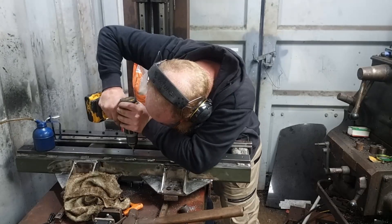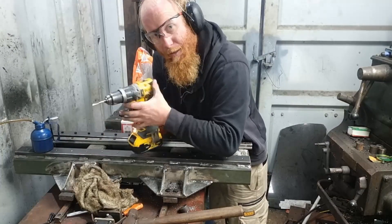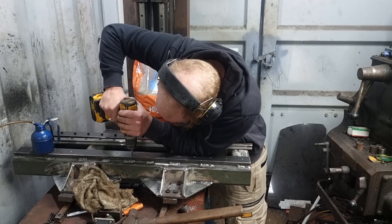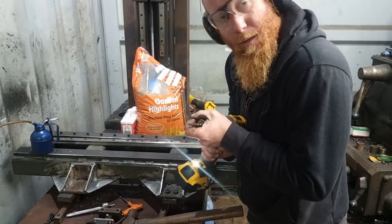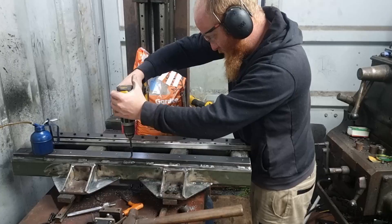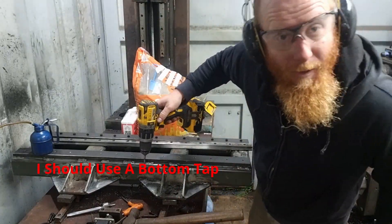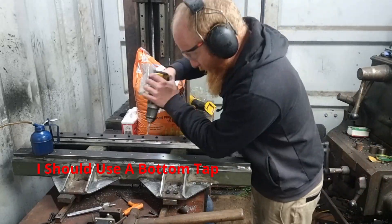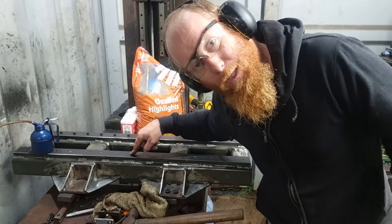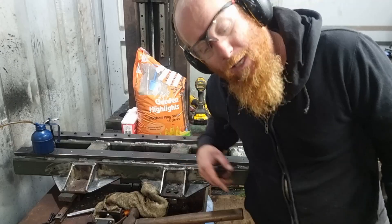Wrong hole. Keep it clean of chips, reapply a bit of oil. Test that hole — it's a little bit tight at the end. I think these taps might be a bit short; you have to cut a really nice thread on the bottom of the hole. Oh wow, that's the broken bolt fix and the missed hole tapped. So I guess we'll chuck all the bolts back in and start filling it with sand and epoxy.